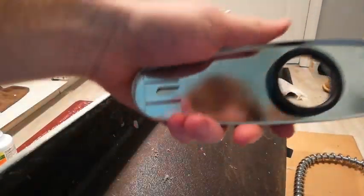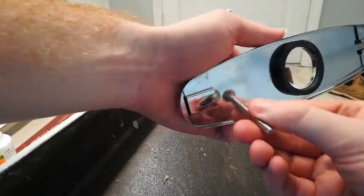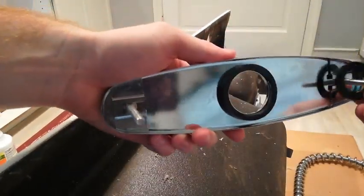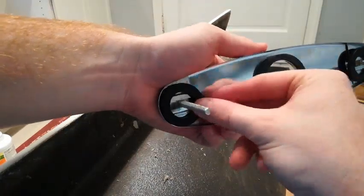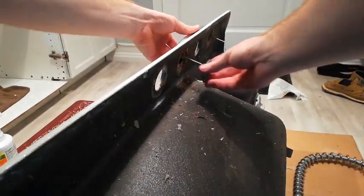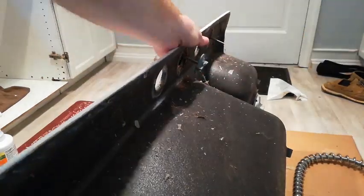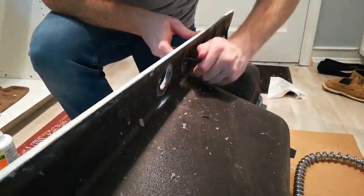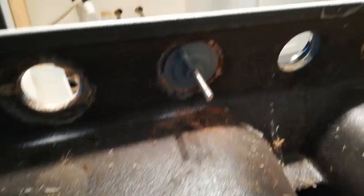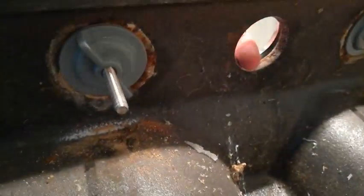So the way that you put on this plate: first it comes with a little screw and you slide it in, one on each side, just like that. Then a washer for each side. Then you put it in position and you have these little nuts that slide onto the back. This is what it looks like from the back side when it's screwed in. This little plastic piece on both sides holds it in place, leaving this the only hole for the faucet.